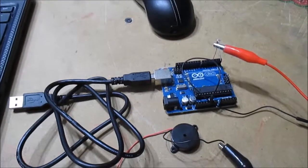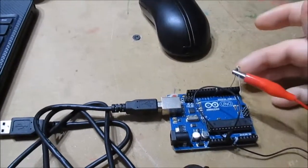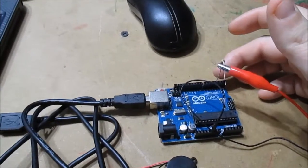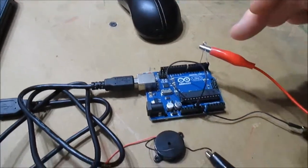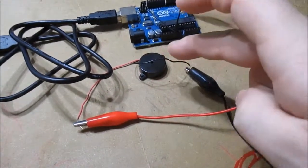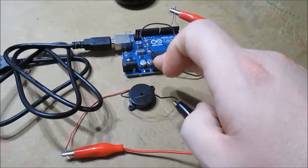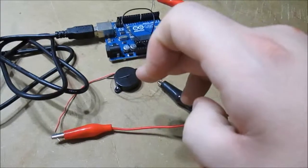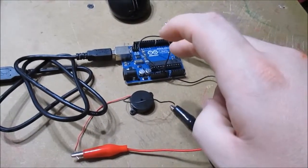I'll show you how the Arduino is wired up for Super Mario Brothers. Basically, I have a resistor plugged into pin 3, which is pulse width modulated. It comes out, goes through the resistor, comes down to the positive side of my buzzer, and the negative is grounded out right here. So: ground, buzzer positive, resistor, pin number three.